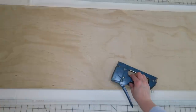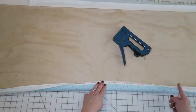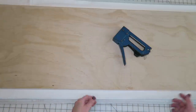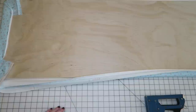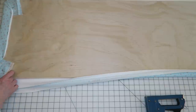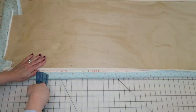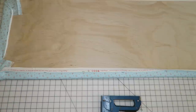For the longer sides, I'm going to staple the centers first, then the far corner, and then fill in the middle of each section. You're basically working here, middle, end, and then placing staples in between. This helps so you don't end up with puckering — if you start at one end and push fabric all the way, it can pucker on the other end. Always start in the middle on a longer surface and work your way out. I'm doing the same tucking motion, folding it like a present, on both sides.